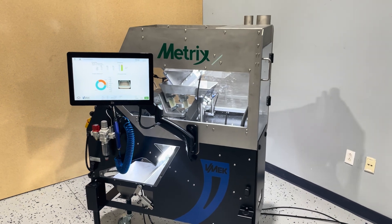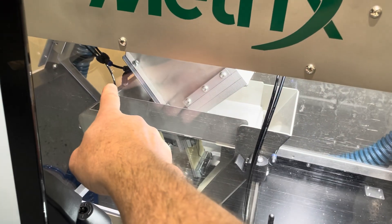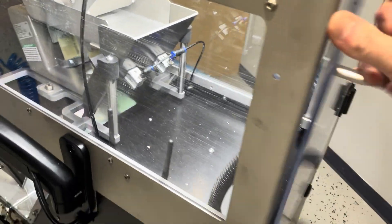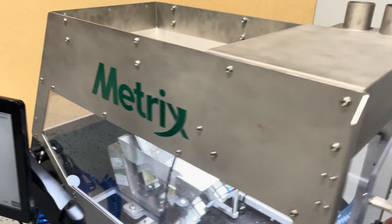To verify complete seed clean-out, we've implemented two new technologies. We have our feeder pan clean-out, which we've had before, as well as our flap clean-out, but now we've put in two cylinders so we pop the flap open evenly. In addition, we have a vibrator that shakes the feeder to make sure there's nothing stuck in the hopper.